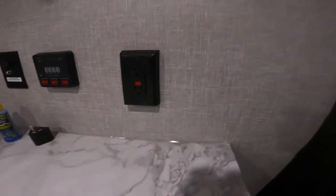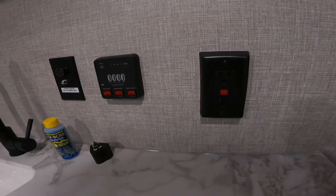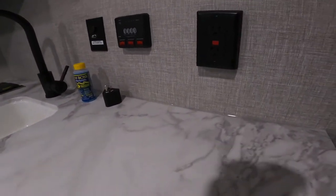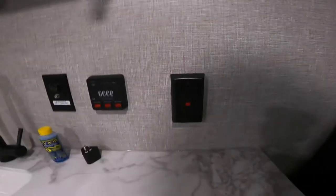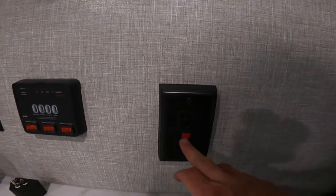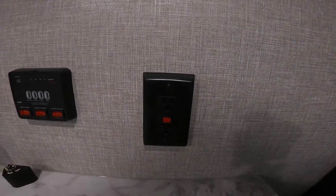Right next door to there, we have your GFCI plug. This GFCI plug carries the load for all your receptacles near water. In these smaller units, it may also power other plugs you wouldn't expect. Generally speaking, any counter plugs, bathroom plugs, and outside plugs will always be on the load side of this GFCI. If it's tripped, the light will come on and there will be no power to anything on the load side. Just press the top black button to reset it and everything should function properly.